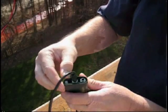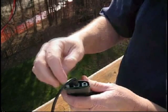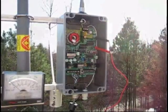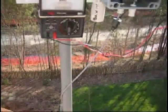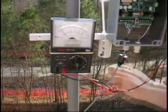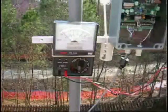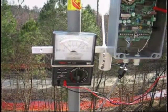Here is the audio gain for the board — plus or minus 6 dB. This is the gas tube for lightning protection. It's important for lightning protection that there be a good ground all the way to the dirt. You don't want to connect it through a metal mast or pole. You want a copper path going from the binding post all the way to the grounding rod.